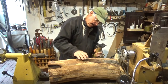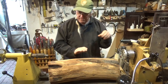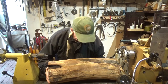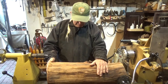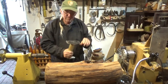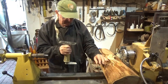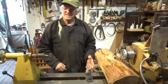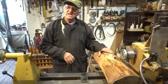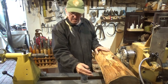Since I know this piece is 24 inches long, 12 inches is roughly center and it should be balanced. But I have a knot that's sitting on the ways, so I'll mount it from underneath. For simplicity, I can just drop the jack in and it locks in place at approximately 12 inches center. If it's not centered, no big deal — put one hand on the piece of wood, balance it, and either lift it or push down to bring it into center. I've already got my wood marked on each end where center is.